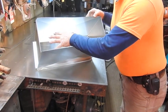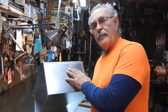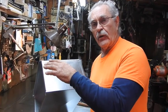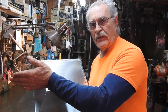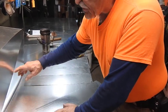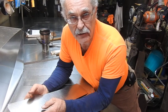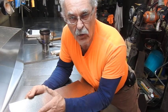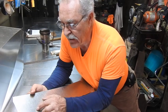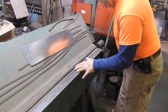Now we have to go about fabricating a pair of rotating dampers that will block off the vast majority of airflow in this trunk. I'm making these so everything is in alignment with the dampers in the electric air handler, so I can mount one actuator and use a connecting rod to actuate the four dampers in the supply plenum and the two dampers in this fitting. I went ahead and cut two blanks at 19 and three-quarter inches long for a little play on each end, starting with four and three-quarter inch material to make the interlocking edge folds.